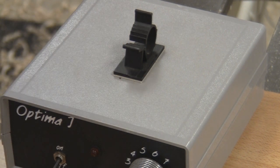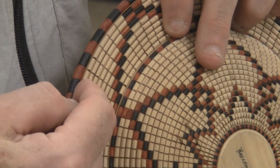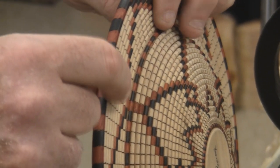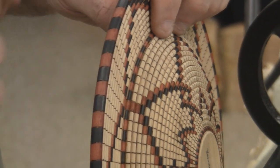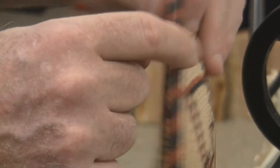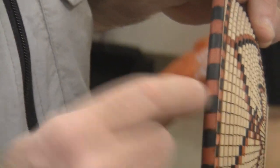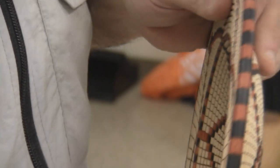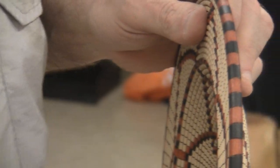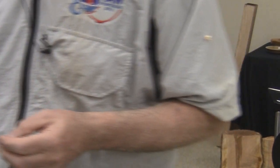So I'm going to talk about the rim for a minute before I actually do the burning. In my early days when I was doing the rim, I would just wrap the line around — take this line here, connect it to the same spot on the back, and burn that. And that's where I would use the three-sixteenths or the quarter-inch pen. If the pen didn't fit, I'd have to use a burning skew. Usually the quarter-inch pen fits, so you might have to use a combination — the three-sixteenths pen on the front of the bead, on the back of the bead, and then the quarter-inch pen to get the top of the bead. The first batch of pieces I did all had that rim treatment, but that's not really the good way — that's the easy way.